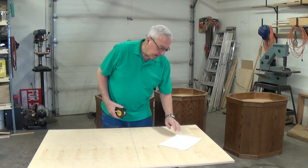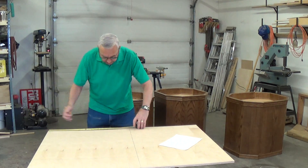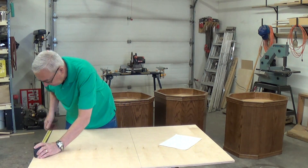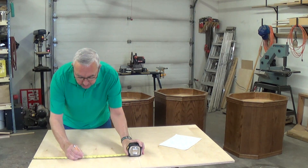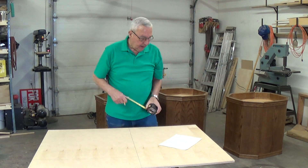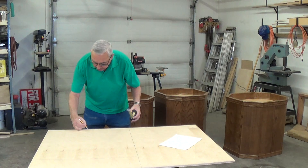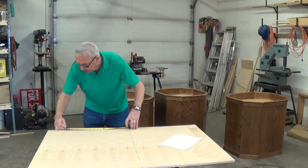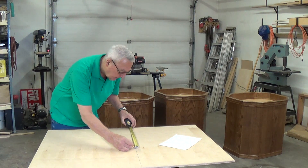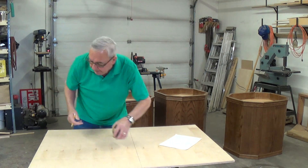He has written on the sketch that this side here is a 14-inch piece. So what I will first do is measure to the center of these 26 inches, which is 13 inches, and put a mark there — doing the same on all four sides at 13 inches. Since the longer panel is 14 inches, half of 14 is 7. So from the center mark, we go 7 inches to each side, marking at 7 and 14 all the way around. Then we can draw in our corners — just draw a line across each corner — doing the same thing in all the corners.